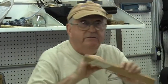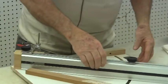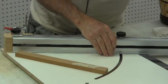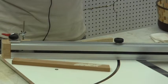One of the tricks I use is when I get this full length, if you notice, there's a pencil scratch on there all the way across the wood. After I sand both sides of this on my big belt sander, Performax, then I just take and scratch this line across. Because when I'm doing this cut, let's say I want 8 segments, so I go down to my 8 segment center, lock this down, and that's done. Okay.